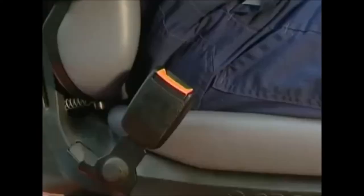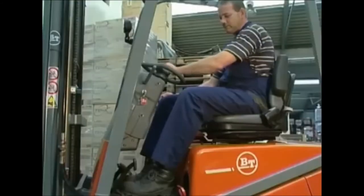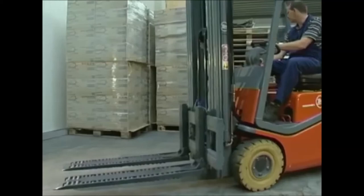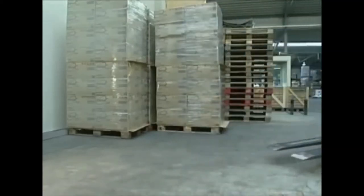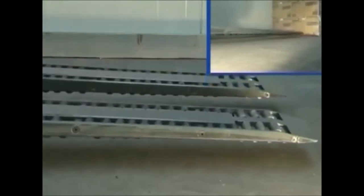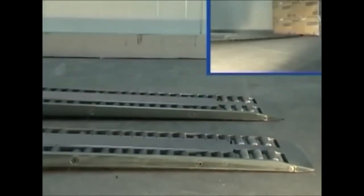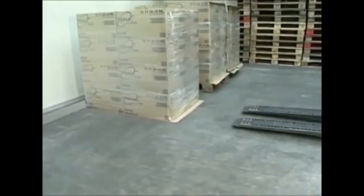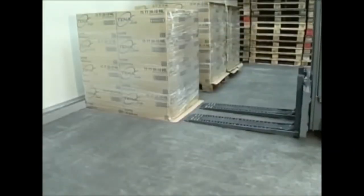The roller forks are now ready for use. When operating the roller forks, always wear the safety belt. Tilt the mast of the lift truck slightly forward so that only the nose of the forks is in contact with the floor. The slip sheet should stick out 2 or 3 cm in front of the goods. Slide the nose of the roller forks under the edge of the slip sheet and just under the front edge of the load.